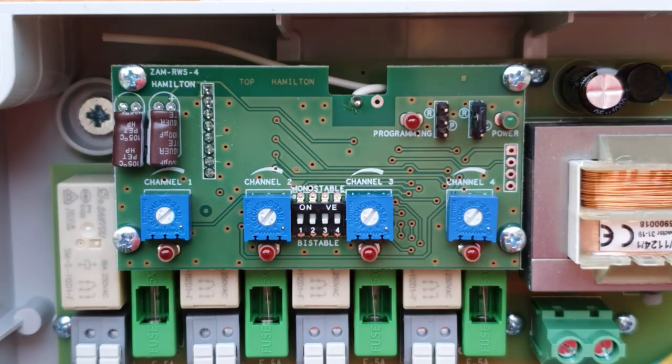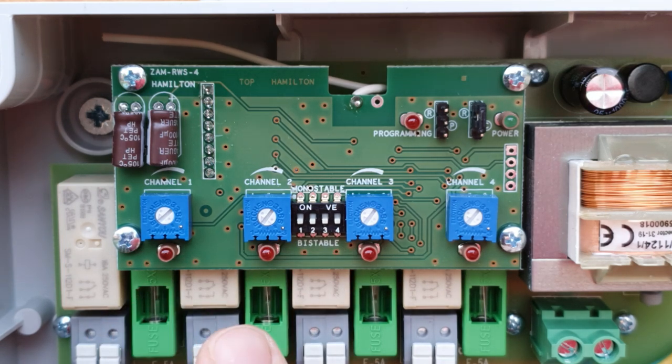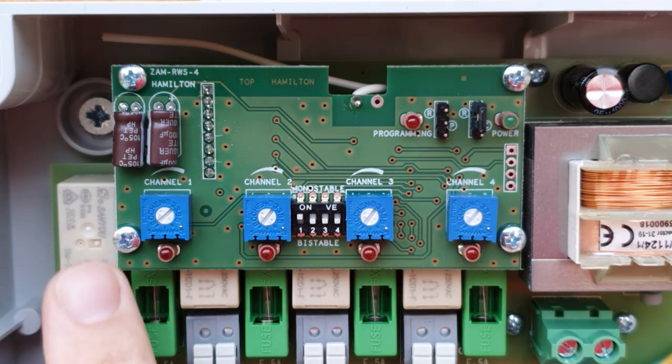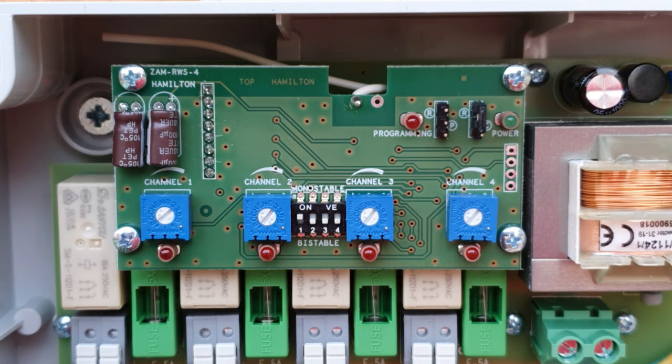Let's come back to the internal technicalities of this smart bit of kit, because it actually has another super helpful feature. In the middle of the PCB here we can see a little row of DIP switches — there are four of these, one for each channel, and they change the function of the channel from on/off to timed. If I move this first DIP switch into monostable mode, that means channel one is now in timed mode, so when I trigger this channel it will turn on and remain on for a preset period of time. You can change that period of time by twisting this little dial here — the channel will remain switched on for up to four and a half minutes, and each channel can be controlled independently.